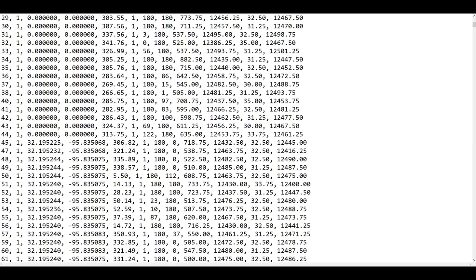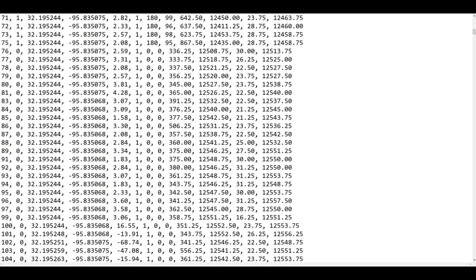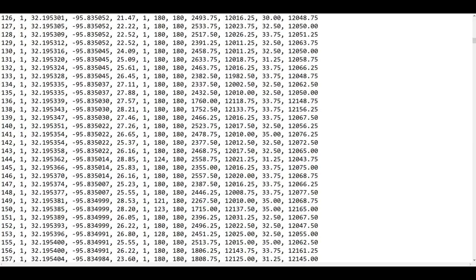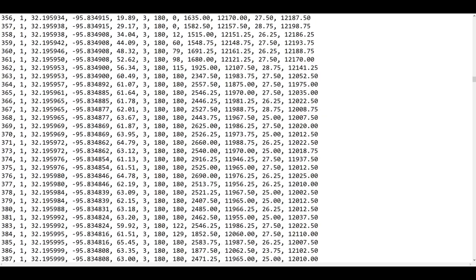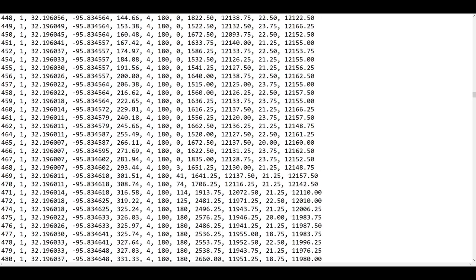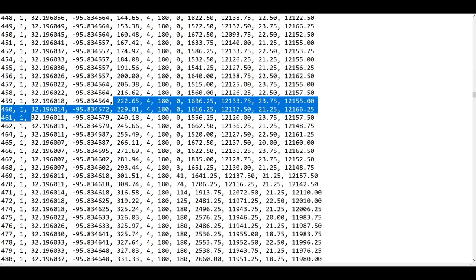It records a black box of a few key parameters as it goes with a sampling rate of about once per second, and it outputs it to this CSV type file like this. Over here is the time since startup in seconds. This is the mode, one being auto, zero manual, GPS, compass heading.